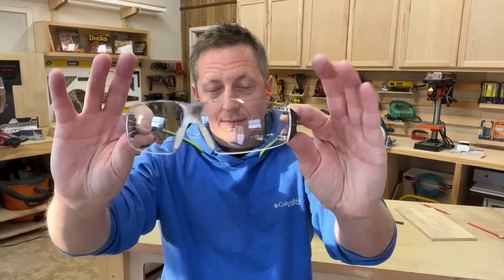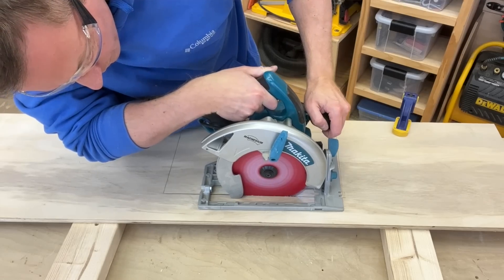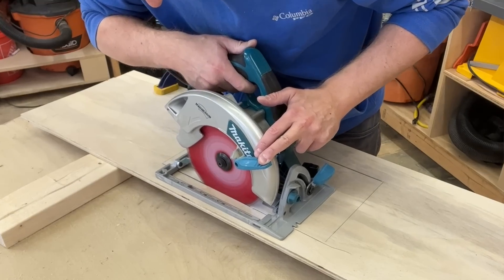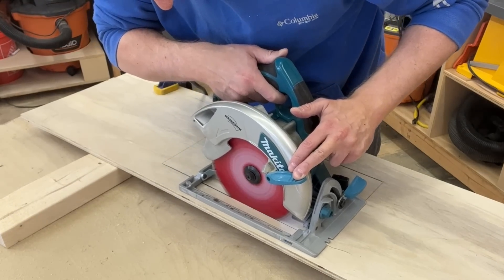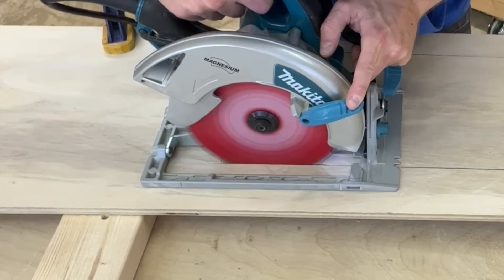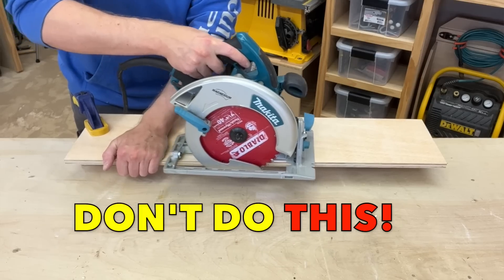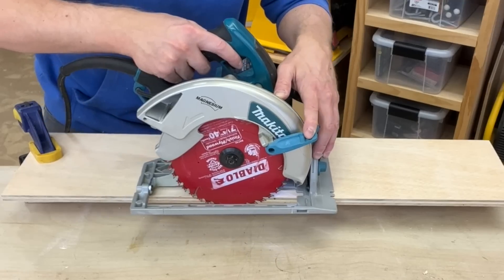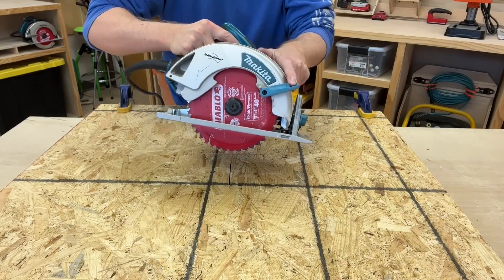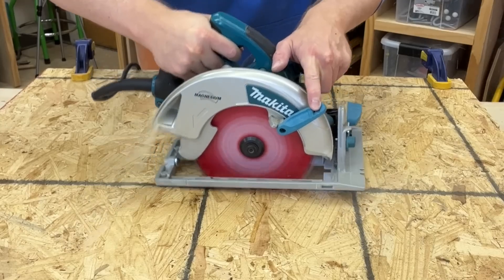Here are some things to remember. Wear safety goggles because you have to sort of look over the saw when you're cutting and particles can leap up. Make sure your cut surface isn't too high because your elbow has to get really high when making this cut and you don't want to sacrifice control. Be careful that you're not starting too far back — circular blades can overcut when you finally sink them, so try to get close to your starting point but not go over. Don't put your free hand behind the saw and don't grip the material with your fingers underneath. The most important tip: never lift the guard and try to float the blade down into the material. This is the ultimate no-no — it's even worse than loose plate cutting. It lacks any stability, it's likely to kick, and it's also really unlikely to give you a clean cut.